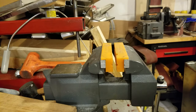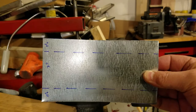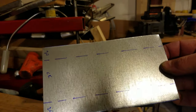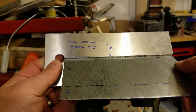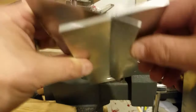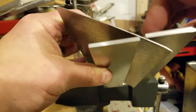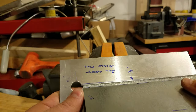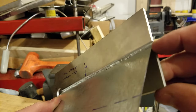I apologize for the mess in the background — the shop is getting a little obnoxious. What I have here is that rough cut piece of material; it's not finished yet and doesn't need to be until you're done trimming it to size. I haven't deburred any edges and I don't need to yet. To set this up, depending on how you want your joggle to go, you slide this in here. In this case I want the joggle to go away from me and then flare up. This part is going to bend down flat against this surface, and this part is going to bend flat up against this surface. Because the upper edge where I've marked my lines is where my key measurements are, I need to put that flat against the piece that's going to bend it down. I'm lining this edge right up with the very edge of the joggle tool.